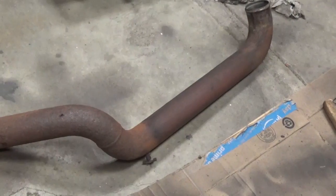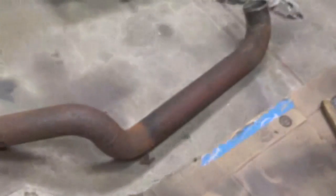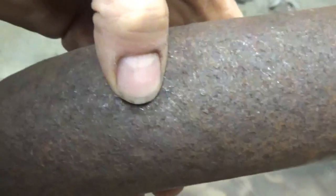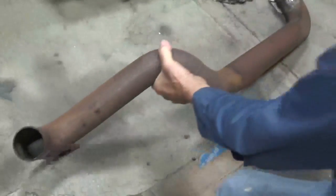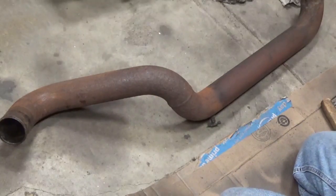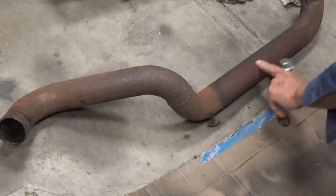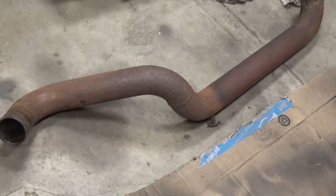What I'm doing now, I'm going to try to record, is burning the rust. The rust is in bad enough shape on this thing that, see if we can get a close up. This is after a lot of hammering and chiseling. If it was flat or closer to flat, I would have used a needle scaler. I'm not getting a lot of this rust off. It's on there tighter than I thought it was. So, something I've done over the years, just use a torch, and that takes the rust off pretty good. I already torched this part here, and then suddenly remembered I'm not videotaping.